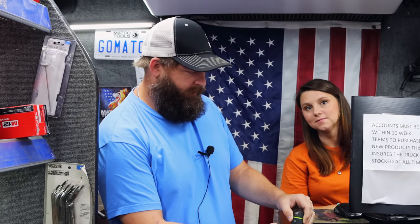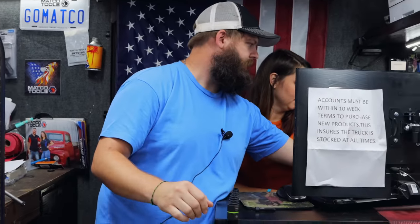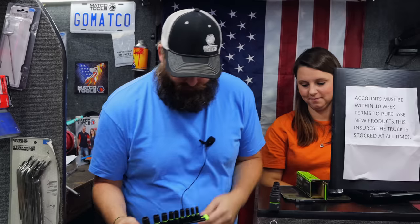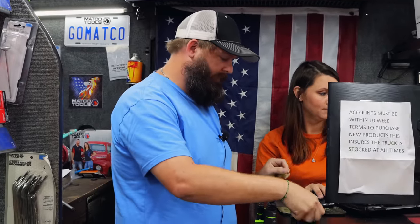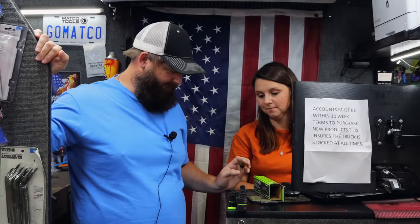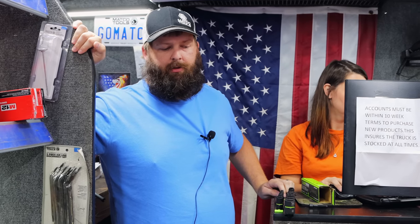One of the things people forget is the reason why a bolt stripped is because it's tight — it's not moving. It's not just because that bolt decided to round off. You've all been in that situation where you have to go a little loose, back and forth, to try to get it out without breaking the bolt itself off. But sometimes you have to put heat on it. The cool thing about these is if you need to take your extractor off to add heat, all you've got to do is thread that rod down, pull the extractor off, throw a little heat on it. And with other extractors, when you finally do get a good bite and then realize you need to take the socket off, now you're backing up on all that progress and having to go down another size.